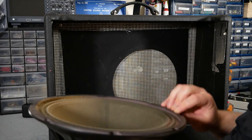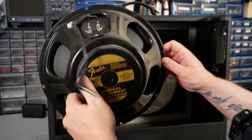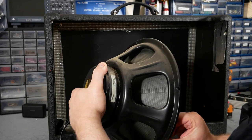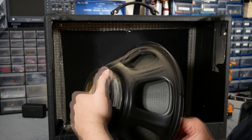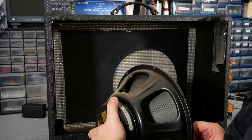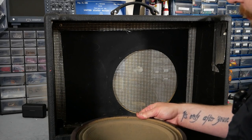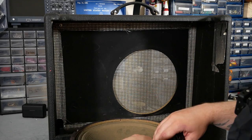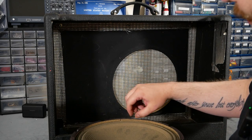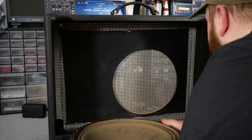So we've got the speaker pulled out. This is a 12-inch speaker. It's marked with a label — the EIA code is 121042, and the tag here is marked 037, which might be 617, so that'd be the 6th week of 2017 maybe. Then 8 ohm. Seems a little bit dusty, but the cone seems to move freely — I don't feel any scraping. It's nice and springy. So this speaker should do fine. We'll try and clean up some of the dust, but it's not too bad.